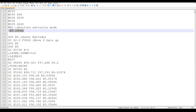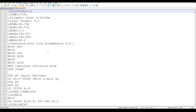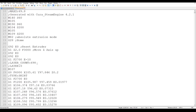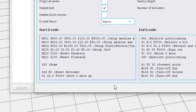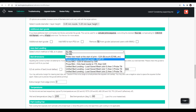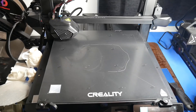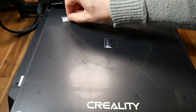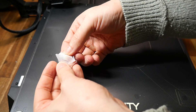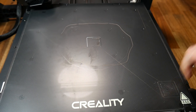The first clue comes from inspecting the pre-sliced G-code on the SD card. G28 is there for homing, but there are no commands to either probe the bed or restore a saved mesh. The same goes for the start G-code in the provided slicing profile. I prepared a first layer test trying out the various ABL options, and even when I opted to have the bed probe immediately before printing, it was clear no mesh compensation was being applied — the initial square was good, the back left too far away, the centre far too close, and on the right hand side I had to stop it because it was just grinding the glass.